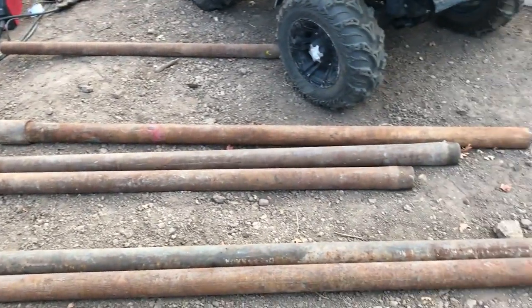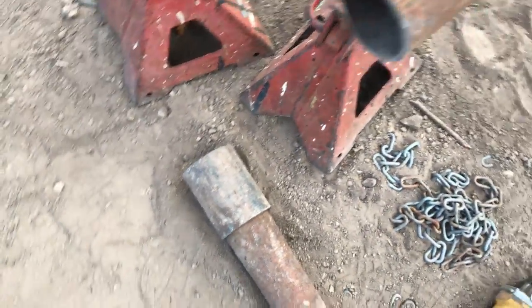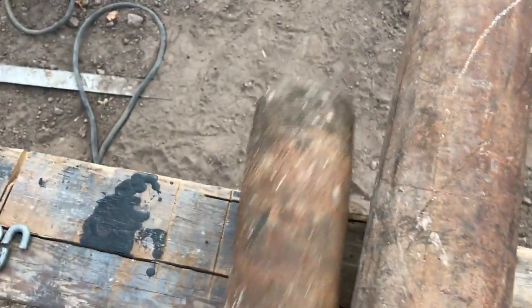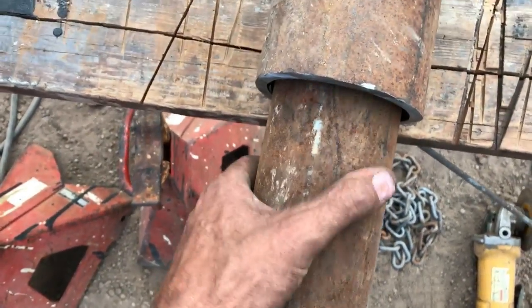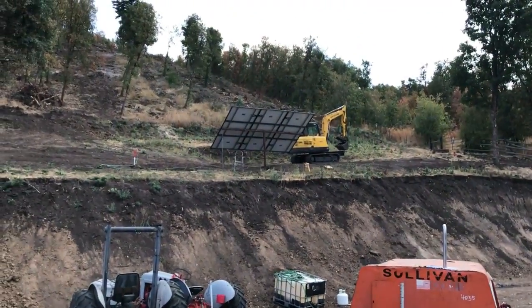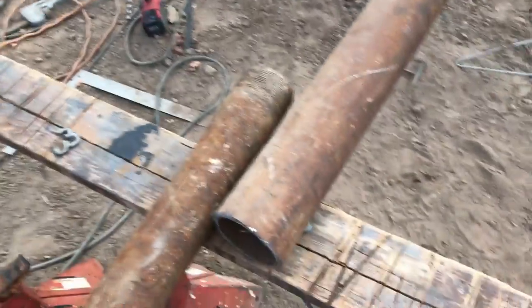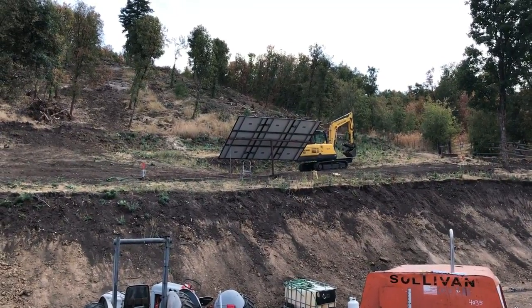For the most part it's all three-and-a-half-inch well casing. Rather than paying five or six dollars a foot I bought the scrap pieces and paid by the pound. What I figured out was when I cut the bell — that's the threaded coupling on the pipe — the bell fits perfectly up in there. The pipe itself is a little bit sloppy but the bell, the threaded part, is really tight. So I made the upright post so the top of the bell was closest to the very top of the pipe, and where I used the four-inch for the sleeve it fit perfectly, adjusts perfectly, and it's not sloppy at all — especially once I use the set bolt.